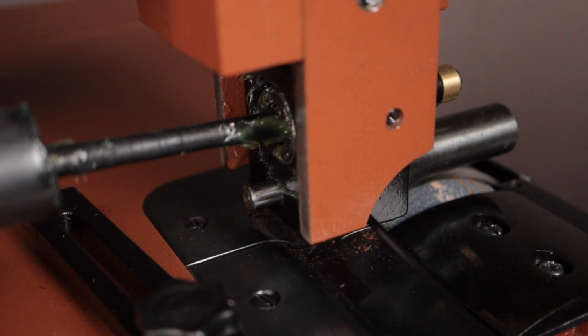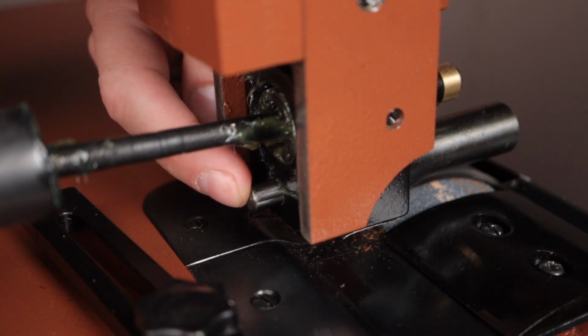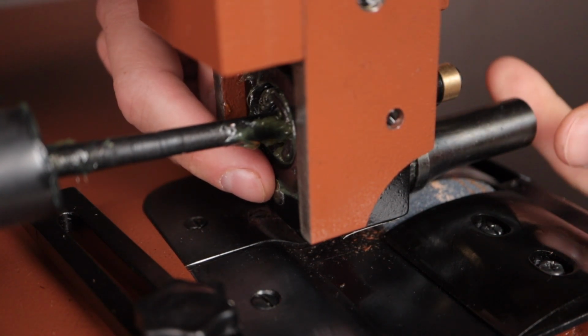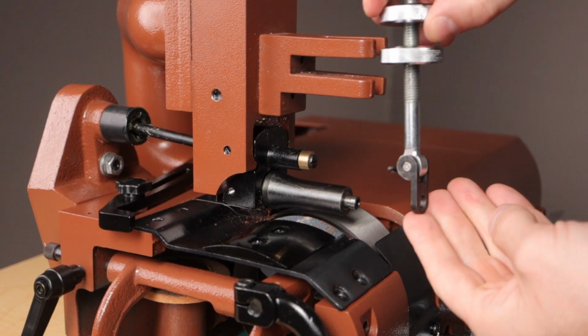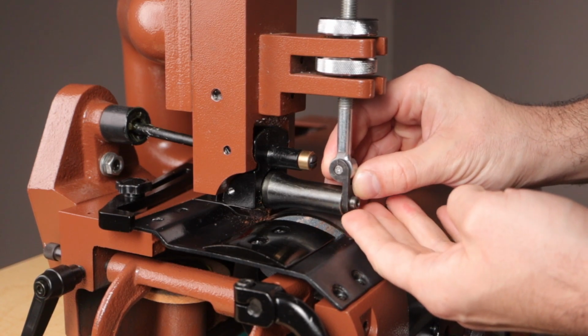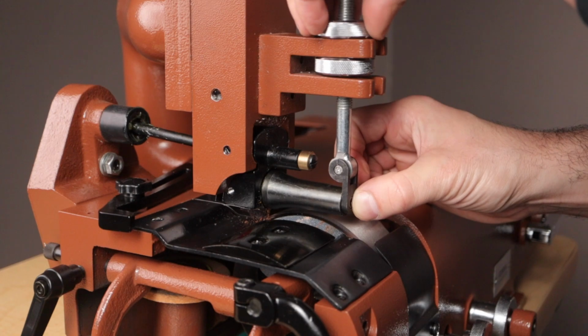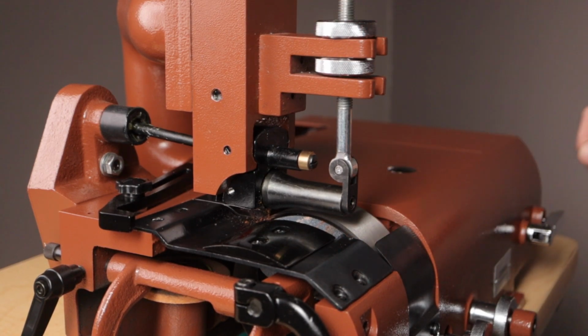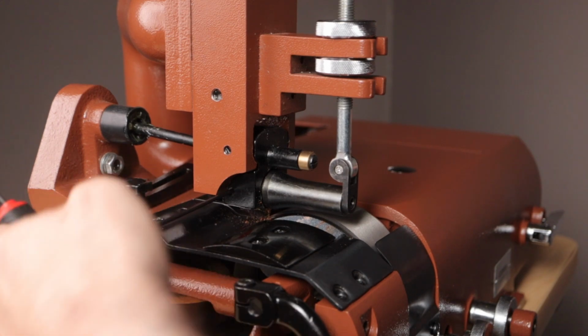Put the straight top roller back into place and loosen up the Allen screw. Then in the back of the block, push the center shaft out. Now the top roller adjustment knob and pivoting bracket can attach to the center shaft, and make sure you push it in to make it flush for the end screw. Tighten down that Allen screw and then attach the end screw.